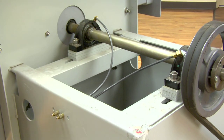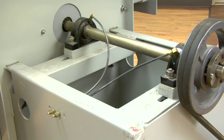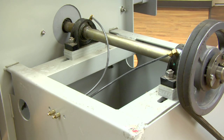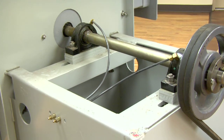In the IOM manual it will tell you, based on the type of fan, the size of the bearing, and how fast the fan is running, how much grease you need. Typically on a bearing like this you may need two cubic inches, and your zerk fitting zerk gun will tell you how many pumps that is. The schedule in the IOM will tell you how often you need to grease it — typically it's about once a month.